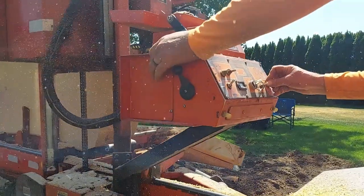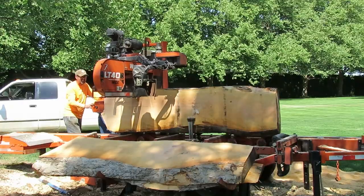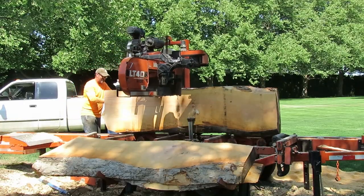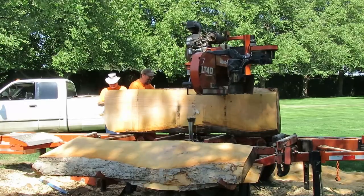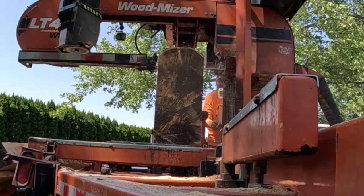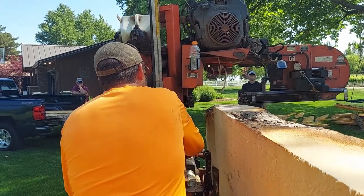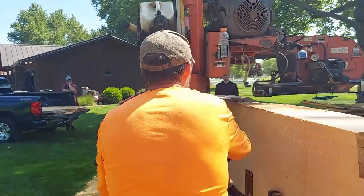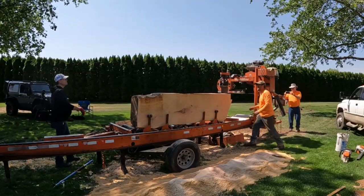And all of those require kind of a different approach. So can you flat saw for paneling, for fencing, for construction grade? Absolutely. In fact, you can, and you'll produce a lot when you do it. You do need to pay attention to stress. You do need to think about how the lumber is going to react when it dries. But it's very important to understand your production sawing.